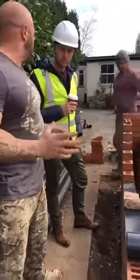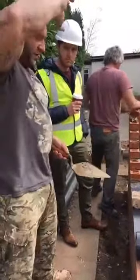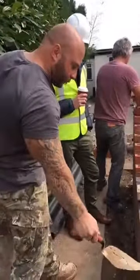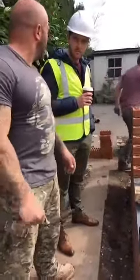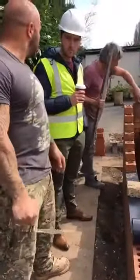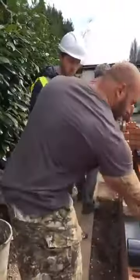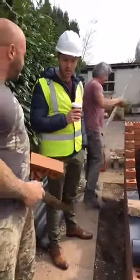Basically it's one tight unit — fantastic. The flat roof comes on and it's down to the fascias and all the rest of it. We're using Class B engineering bricks all the way up, following the existing brickwork — and those on the existing house are also Class B. An engineering brick stops water going into the face of the brickwork and blowing out, so all the face is nice and smooth. It's just much higher quality brickwork.